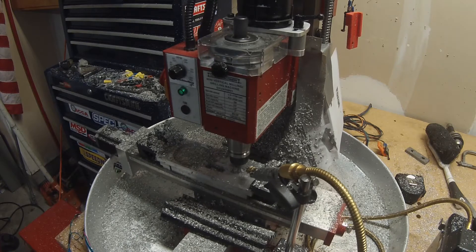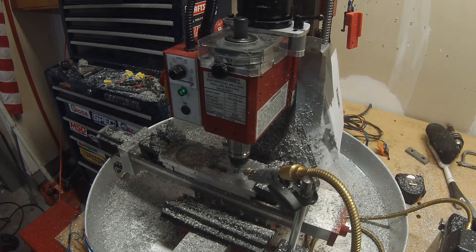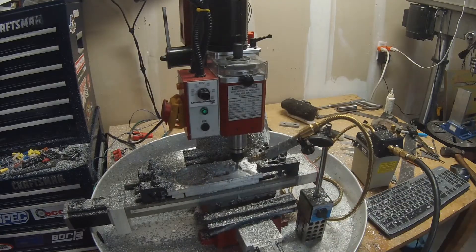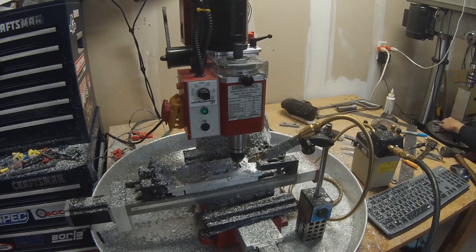This is going to be a square portion — I think he's putting a piece of square tubing in here. So once again, just hogging out the material with the quarter-inch and then we'll go back in and square it off as much as we can with the eighth-inch end mill.